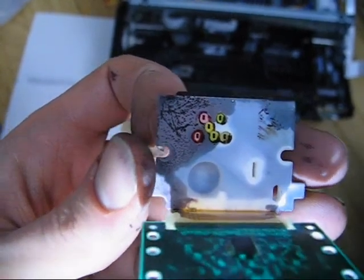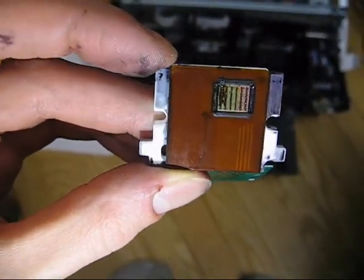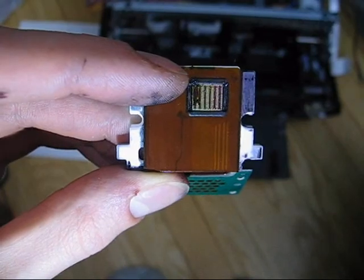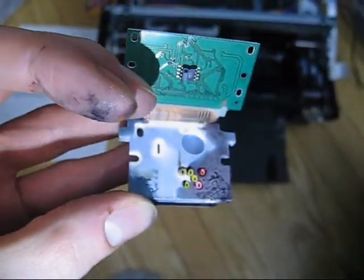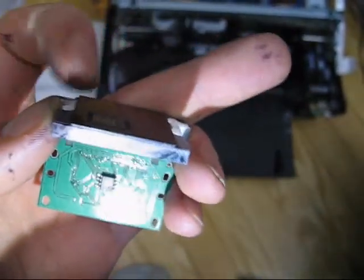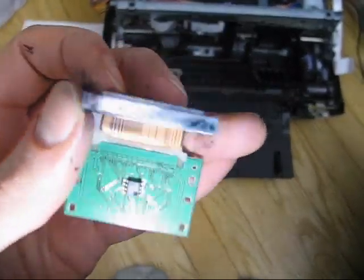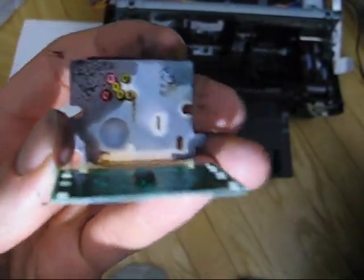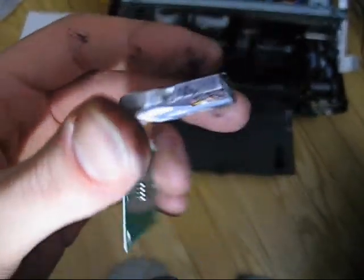There are connections on the back that had some sort of silicone rubber thing on it, and you can see the different colors where the ink came in through. There's a black-looking trace here and some other stuff — I don't know if that's ink or if it actually burned out, but there's some splotchiness and a burned spot on the resin here. It definitely didn't survive — something let out the magic smoke. The construction looks like there's a ceramic card that the circuit is mounted on, and then a huge ceramic backing with ink flow channels, cutouts and everything — it's gotta be laser cut or something. It's awesome.